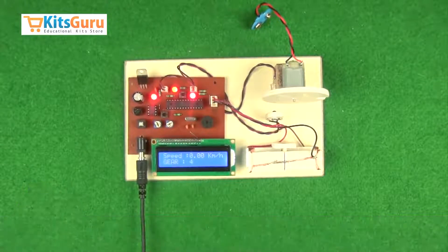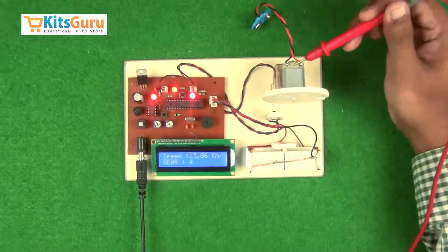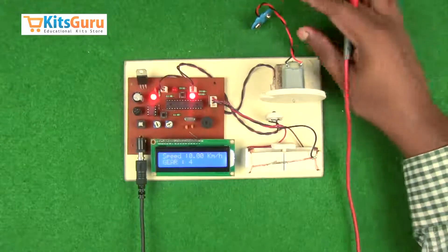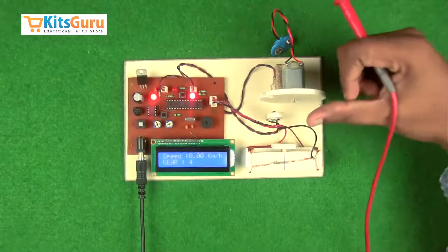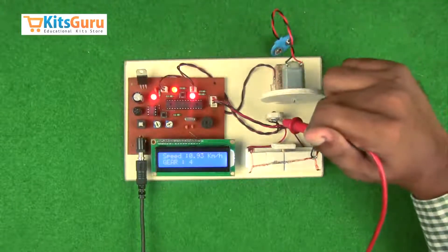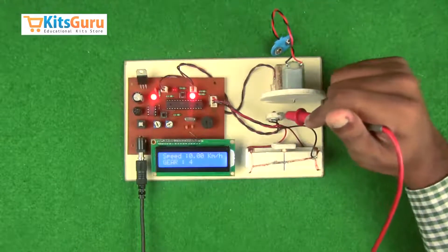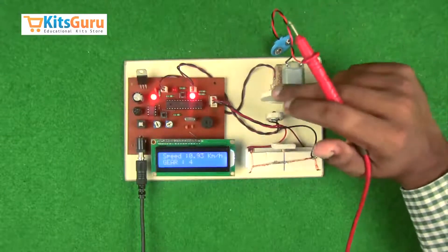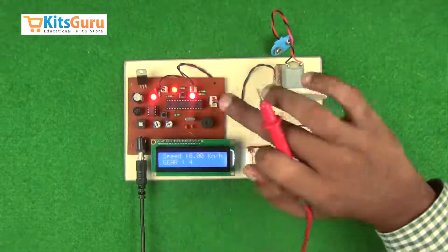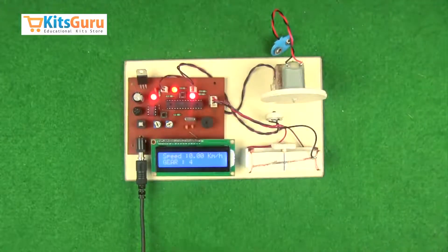As you can see, there are a couple of IR sensors. This is the transmitter and this is the receiver at the other end. There is an open slot in this wheel. Whenever the wheel is powered using a battery, the transmitter continuously sends signals to the receiver, which is blocked by the wheel. But because of the slot, at one particular time the receiver gets the signal, and at that time the microcontroller calculates the speed and shows it on the LCD screen.